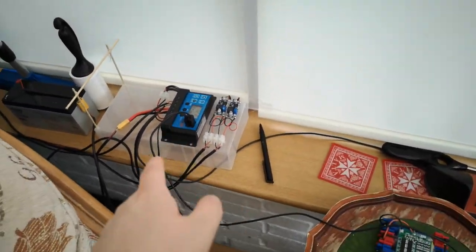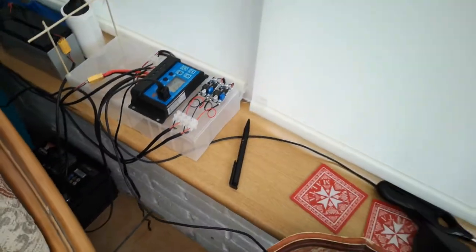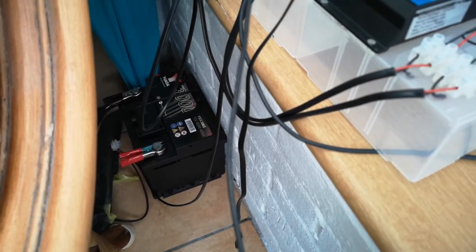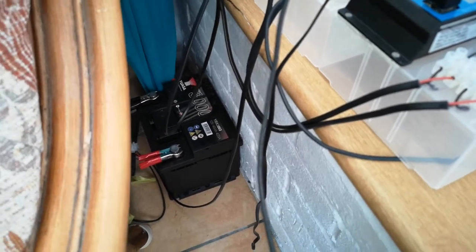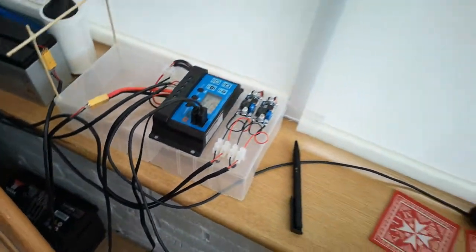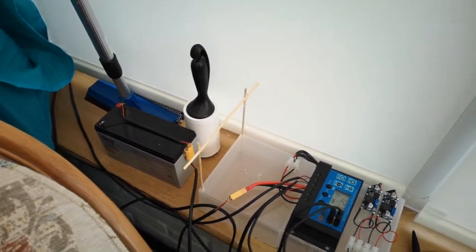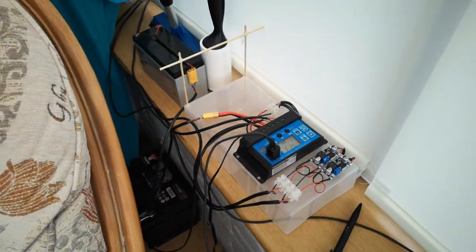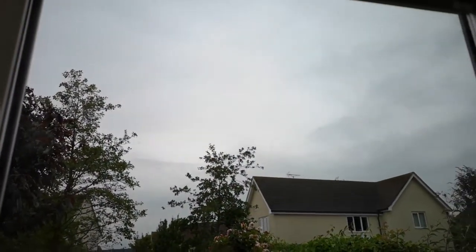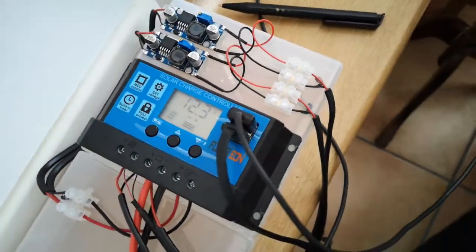So there's really not a lot of power going out. If I have the USB output, it's five volts at two amps, but the input from the battery side is going to be a hell of a lot less. So the battery itself is mostly just there for storage, which is probably the main reason why I think a car battery variety works here. The other battery is in parallel, so in total — since that's 45 amp hours — I've got about 52 amp hours of battery capacity. Even on really bad days like this I've yet to drain it below 12 volts. You can see that even though this is still one of those really crappy PWM controllers, we're at 12.3 right now.